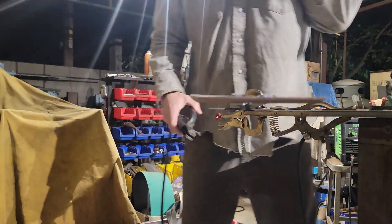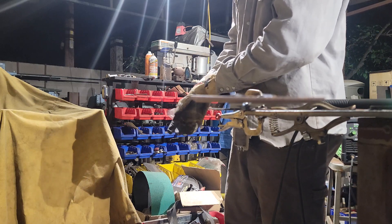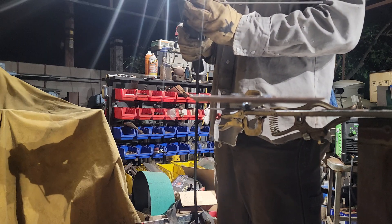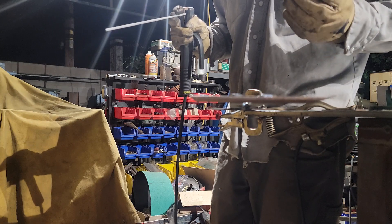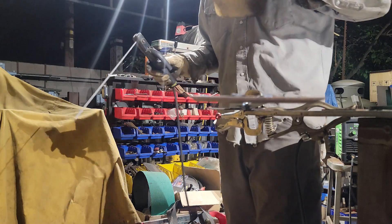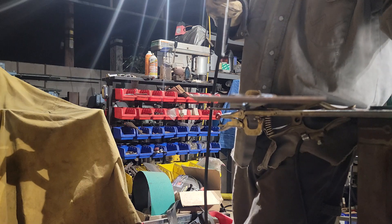I'm running this just a little bit on the cool side because the way gravity works here, it wants to pull my puddle through — and that makes for really good practice. It's almost like if you have a kid and you break their crayons in half so it forces them to focus on their fine motor skills. This is just to give you an idea of what it should look, feel, and sound like, even though you're watching it on film.